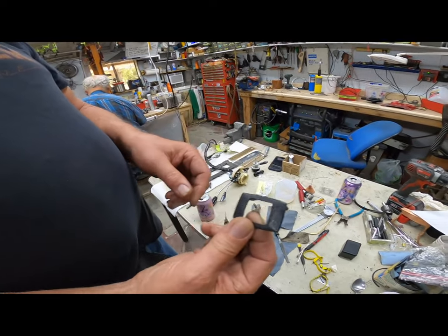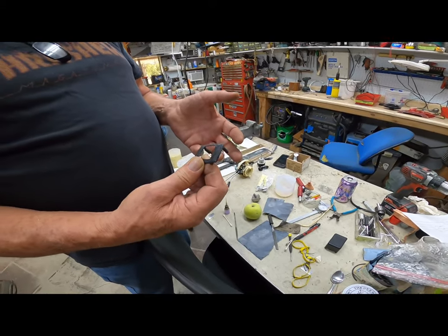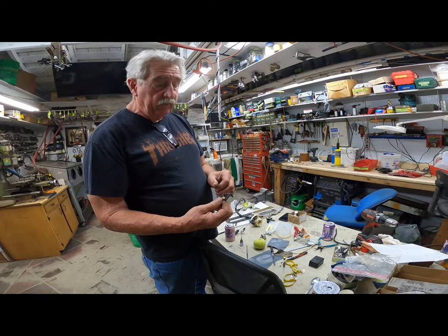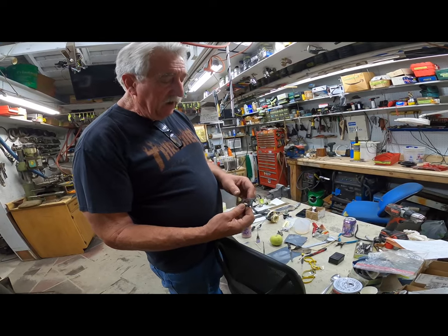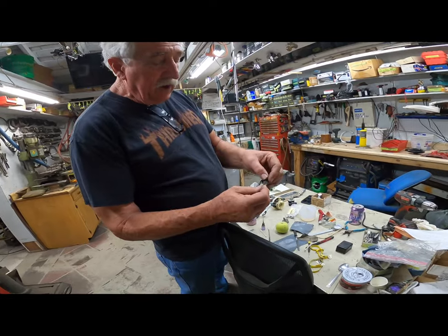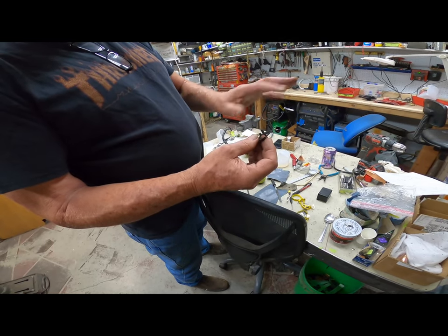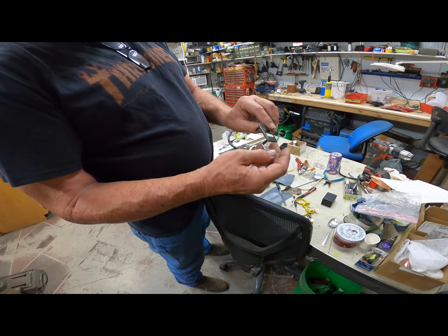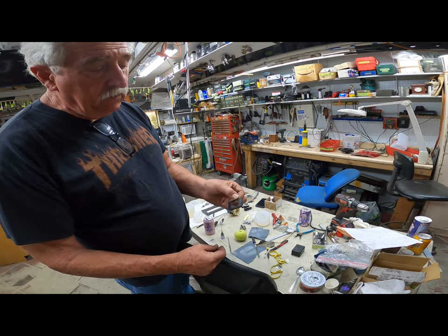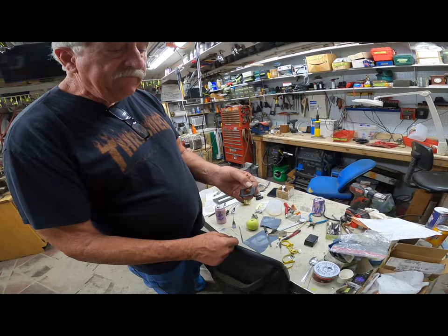This is what they call the 'fall apart' seat belt surround, because when the cars came to the United States they didn't necessarily have seat belts in them. They were aftermarket replaced with a seat belt made by Superior, which turns out to be inferior. This is actually a failed casting because as we pulled it out of the mold it broke, but they're really tricky — they have these little elephant feet with their toes turned out. We cast these in a Reynolds product that is a temperature-cure plastic, and we can get temperature-cured plastics to be very strong.